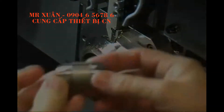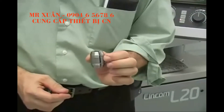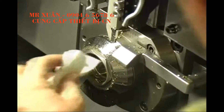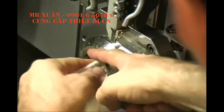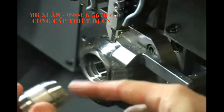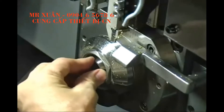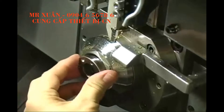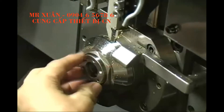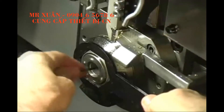This is a custom design for Citizen's new adaptive guide bushing. It self-adjusts up to five thousandths in diameter to accommodate the more affordable non-ground bar stock. Clean the spindle and clean the guide bushing before inserting it into the spindle. The chamfered end goes into the spindle to properly guide the bar into the bushing. Replace the spindle nose cap ring and tighten in place using appropriate wrenches. Lock in the nose cap using the face spanner wrench.